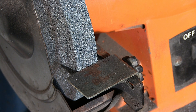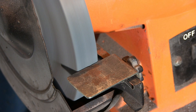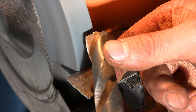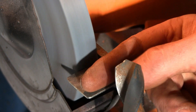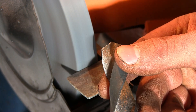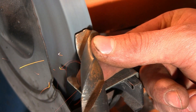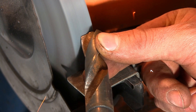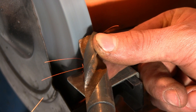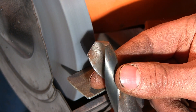In this section I'll try to talk less so you can hear exactly the sound it makes. We start from the heel, come over to the edge, keeping the edge horizontal so it lies in nicely, and then you'll see sparks start jumping over across the edge. Then we return back to the heel — you'll hear the distinct sound of it. Because my heel is quite sharp at this point, I'm going to use the whole surface of the stone so I don't wear a groove in it.